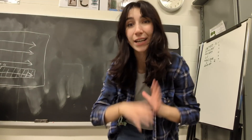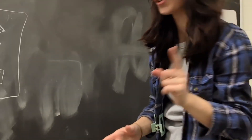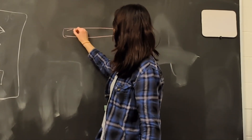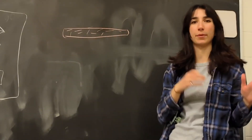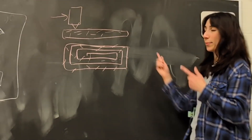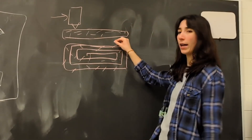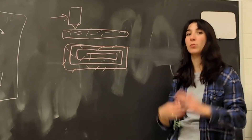What do I mean when I say continuous fiber reinforcement or CFF? Let's start with chopped fibers and your filament. Your chopped fibers exist as little pieces of whether that be carbon fiber, glass fiber, whatever. Even though we can assume in a part printed with chopped fibers that a majority of these chopped pieces follow the direction of the toolpath, printing 10 of these might give you slightly variable performance between each.